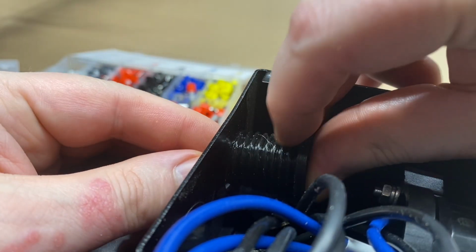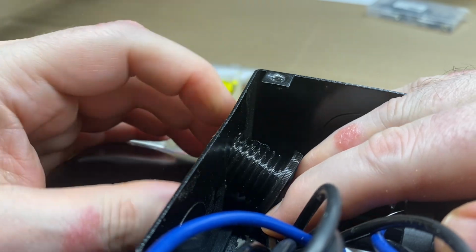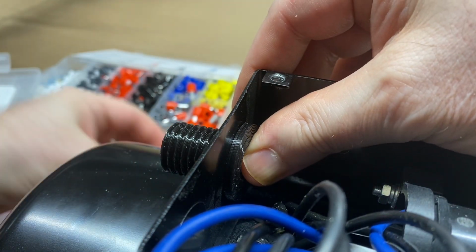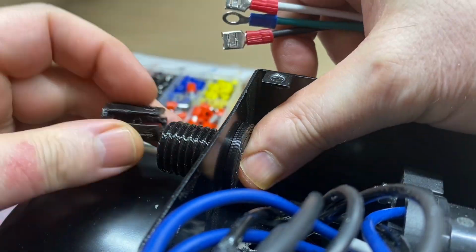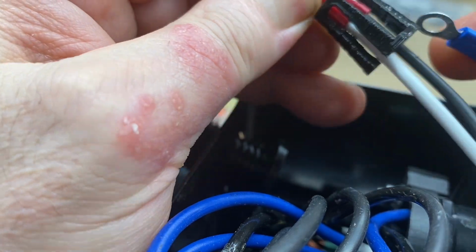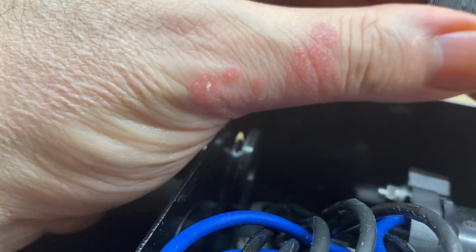Regarding the needed power transmission wires that you see me getting ready to install here, I was able to find a nice thick power cord that was rated for lots of amps, and when I checked the lettering and the identification on it, it matched exactly that which was called for. So I was able to cut off the ends of that power cord, and I used a crimping tool to install the proper terminals on each end, and that power cord has been working great.